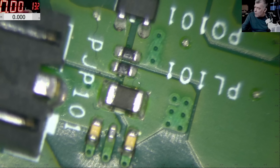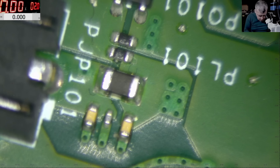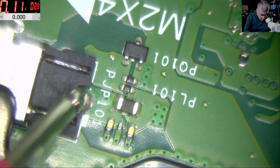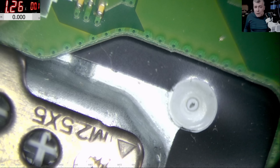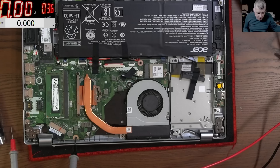Let's come in with some power at low voltage - it doesn't matter anyway. Ground and plus on the middle pin. It is short - sorry, it is shorted. No sparking because it's low voltage, my fault. We can see it's taking about 1.2 amps and the voltage is very very low - 0.01V. Going up to 3 amps we have 0.03V. This short is extremely low resistance, so it must be near the charging port.